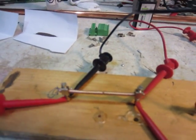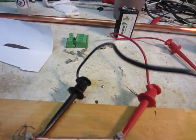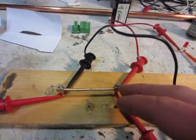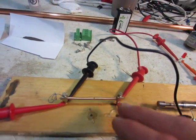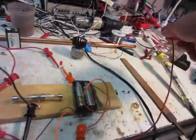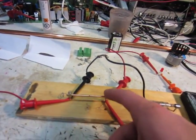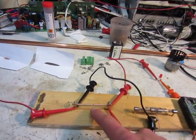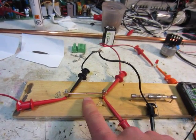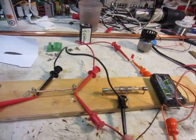But it works. It was used back, around the 1950s or something like that, to pick up and sense radio signals. So this would be the antenna, or one of these two terminals here would be the antenna. And when there'd be a spike of voltage, the little shavings of metal in there would rearrange in such an order that they would start conducting electricity.